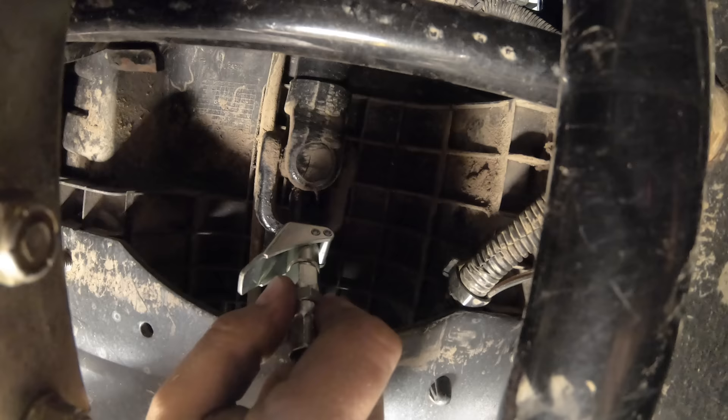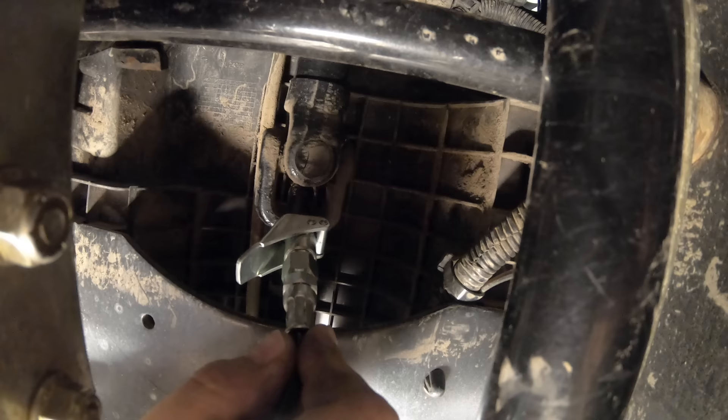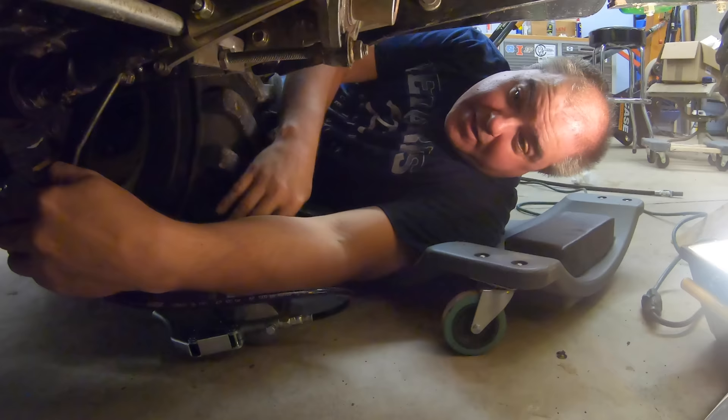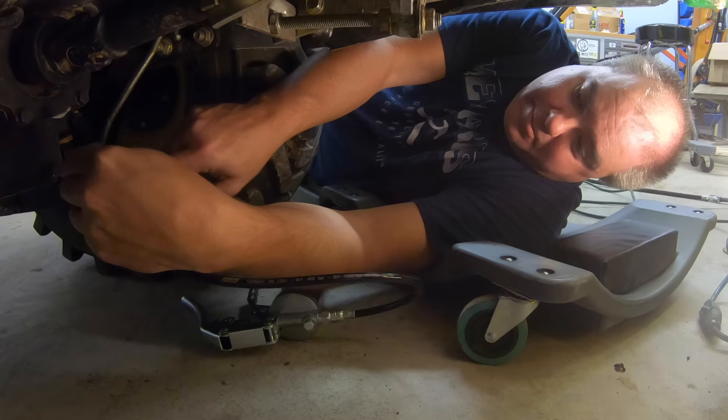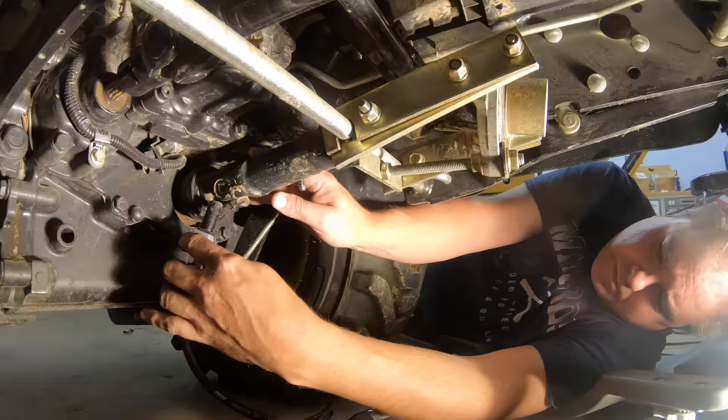I've got it good and tight now — this would be a good place for that one-meter long hose. I am squeezing the pistol grip with my other hand — hear that sound? That is a good sound. Now this is the auto-connect mechanism. It will rotate freely if you have the PTO set in the rear position. If you have the PTO set in mid or mid and rear, this will be locked. You need it to rotate freely so that you can find the grease fitting there.